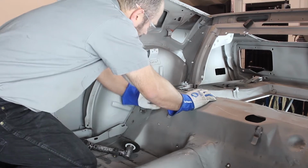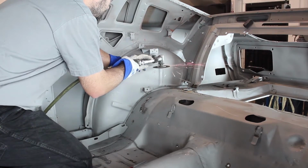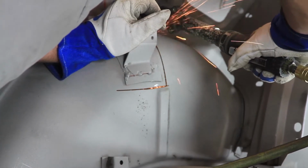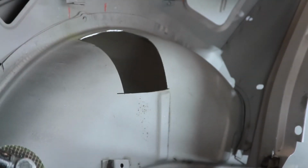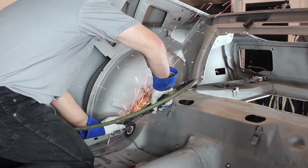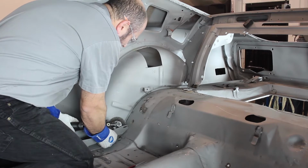Today we're going to show you how to install the Mustang Mini Tub Kit. Cut out the lower and upper seat brackets from the vehicle. These brackets will be reinstalled into the vehicle later. Cut the back of the interior panel bracket away from the floor pan and move it out of the way. It will be reattached later once the DSE mini tubs are installed.